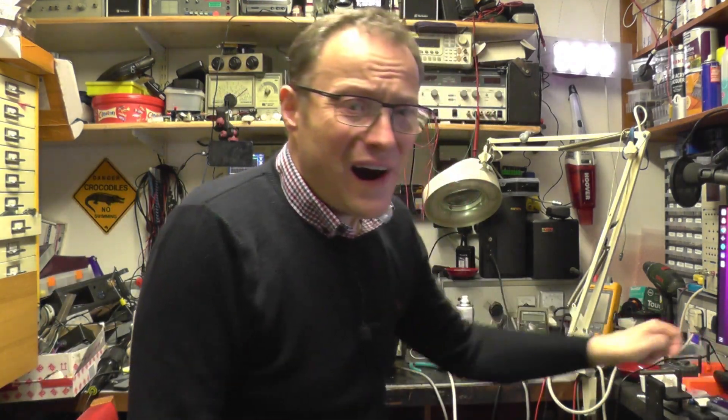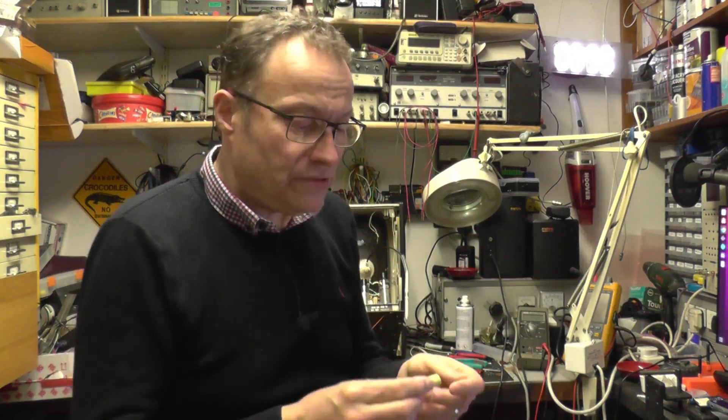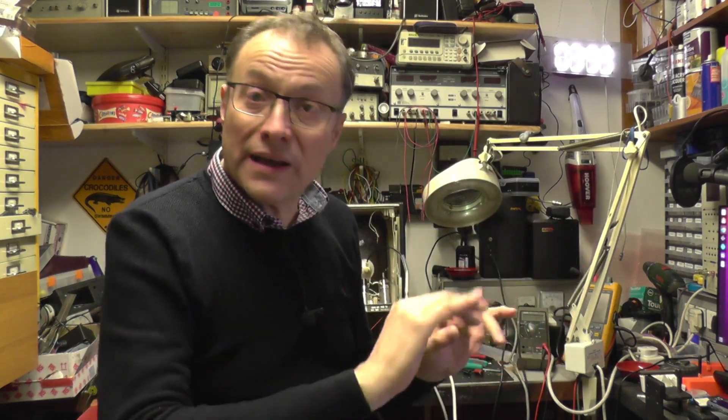I'm going to cheat slightly here because the first thing I did, about 10 days ago, was to change the line tuning capacitor. Its job is to resonate with the line coils — normally in parallel with the line scan coils. That allows, when the line stage stops conducting, flyback, and gives you the scan ramp. Going open circuit usually gives us skyrocketing EHT. On a colour set that's already got 25,000 volts, the EHT can get so large it can actually puncture the glass as the EHT arcs through the neck to the scan coils or wherever else it can find earth.